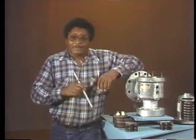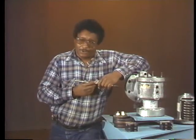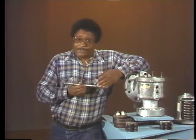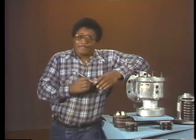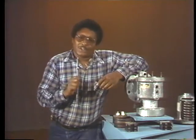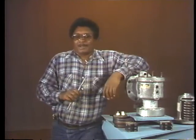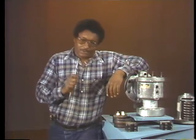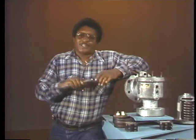To avoid such mishaps, manufacturers establish strict specifications for spindles. Depending on the size and type of the valve, a spindle might be unacceptable if it's bent as little as one and one-half thousandths of an inch along its entire length. The most reliable test of the trueness of the spindle is a run-out reading, which is an essential part of any safety valve overhaul.